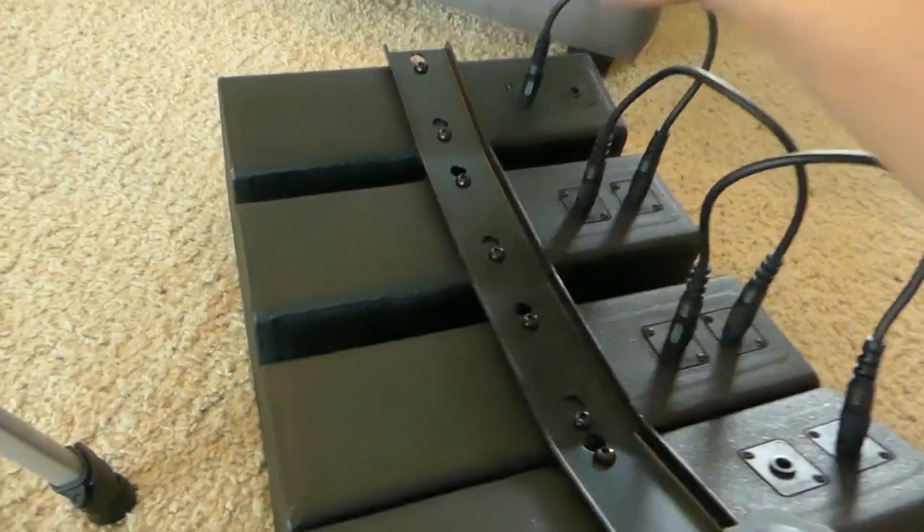Before we look at each component more closely, I want to talk about a few specs. This is the Club 3000, and they claim 4,000 peak watts and 1,000 watts RMS. The 1,000 watts RMS seems pretty in line for two subs and two tops — the 4,000 peak I'd take with a grain of salt. They also claim a frequency response from 40 Hz to 20 kHz. This little 12-inch sub might hit 40 Hz at very low levels, but I'm guessing the minus-3 dB point is probably more like the 50s or 60s — it doesn't really dig the deepest, but you need larger drivers for that.